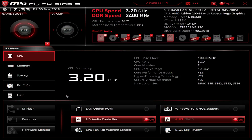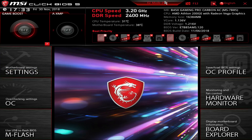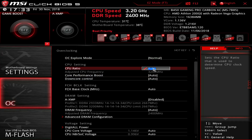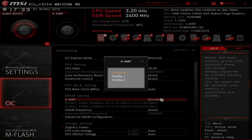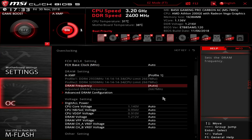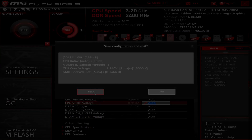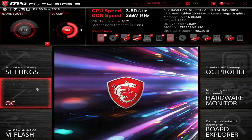After looking into this, it is indeed true. I've also tried a few ASRock B350 and B450 boards, but sadly none of those allowed me to overclock the 200GE. However, all the MSI AM4 motherboards that I tried did, and this included a few budget B350 boards right up to the higher-end B450 models such as the Gaming Pro Carbon. I'm yet to try out any of the ASUS or Gigabyte boards, but I will update you guys with those results in the comment section below. So far, I've only seen reports of this working on MSI boards, so it seems as though MSI has made a bit of a mistake here.